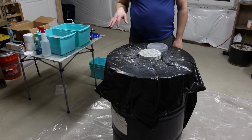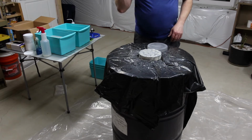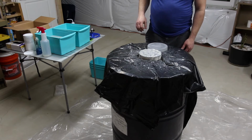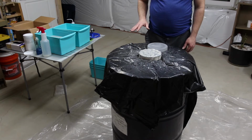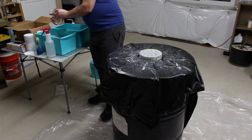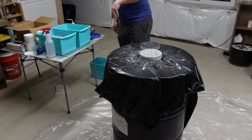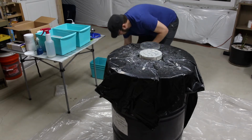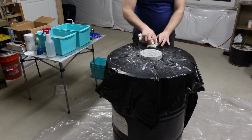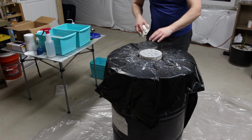So I'm going to continue this until I get to about 44 thousandths of an inch deep, and we'll go from there. I believe we want to take it close but not quite to that depth. So I'm going to continue on here. And I believe that's 2 more. So I want to verify what I was measuring and see if doing a couple of wets drops the center down by another 4 thousandths of an inch.